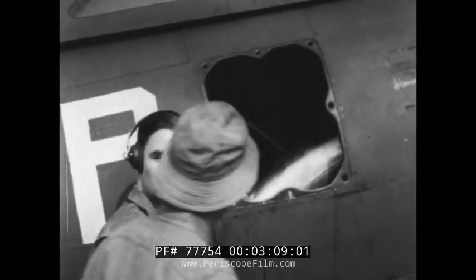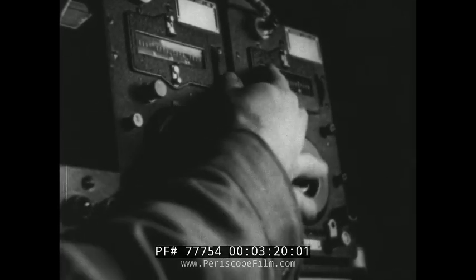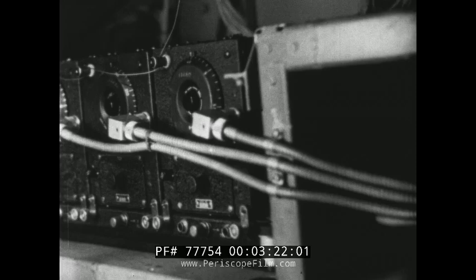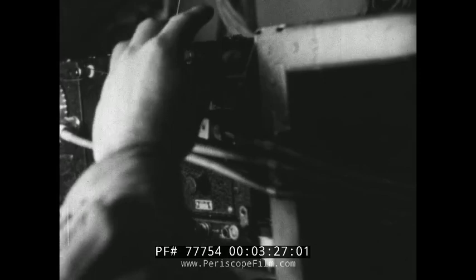Practically inaccessible behind the transmitter is the antenna switching relay — see that all connections and snap slides are in good order. Give the transmitter a couple of good shakes, and do the same with the receiver. This will make a distinctive noise in the headset if there's a loose connection. Make sure all wires and cables are unbroken, and all connections tight and properly safety-wired.